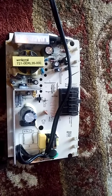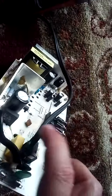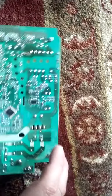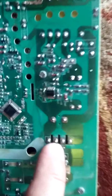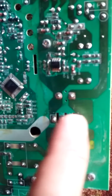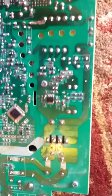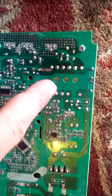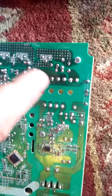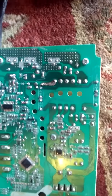Just plug it in — no lights came on, nothing. By the way, another thing I checked: this is the diode bridge right here. I checked the voltages with it on — carefully, of course. You should have AC voltage across here; sure enough, I had line voltage there, and then DC voltage across the outer two terminals. So I knew I was getting power on the primary side — this side of the transformer and all the circuitry — but on the secondary side I wasn't getting what I needed. Now I am, and it works fine.